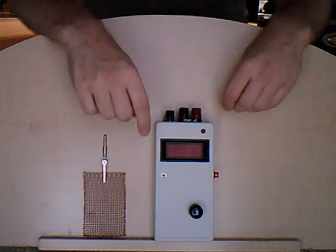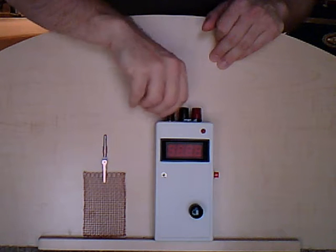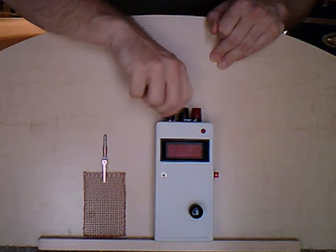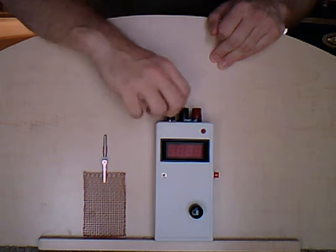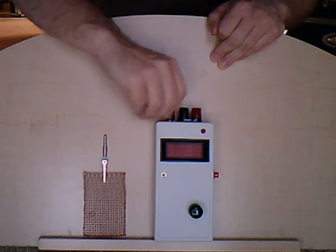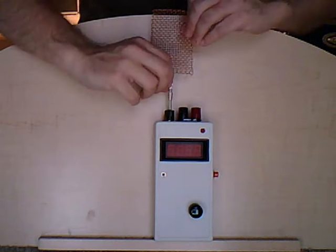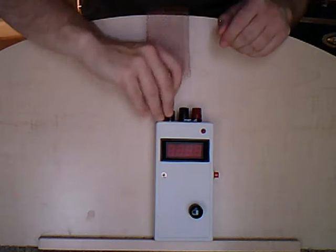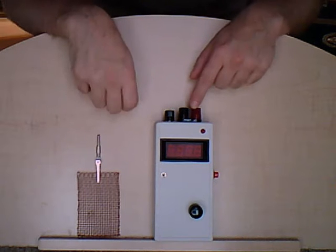Okay. Up here we have the typical probe input, which was available and seen on the EC-150. It's a thumb screw type of connector where you can wrap a wire around it, or you can hook an alligator clip to it, and the top accepts the banana plug type input, so you can make your own little probes and own little devices, and I'll get into how we use this and why we use it a little bit later on.